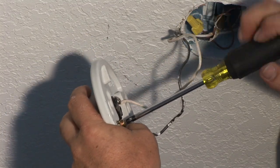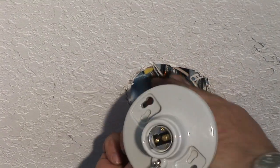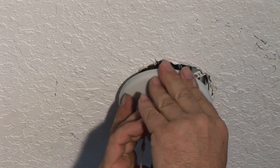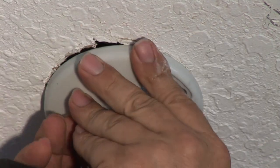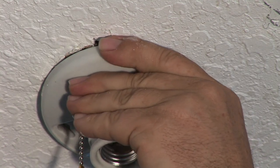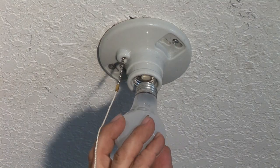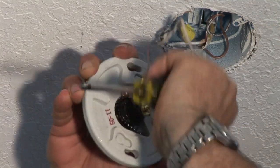Same thing with the black one — you want to make sure that it goes in with the screw. Next, tuck the wires up real nicely in there. Start the screw in the fixture box — there's a little hole that gives you a starter so you can switch it in there. Tighten it up, install the light bulb in the clockwise position. And that's how you fix a lighting fixture outlet. I'm Jim Guidus, CJS Electric. Thank you for watching.